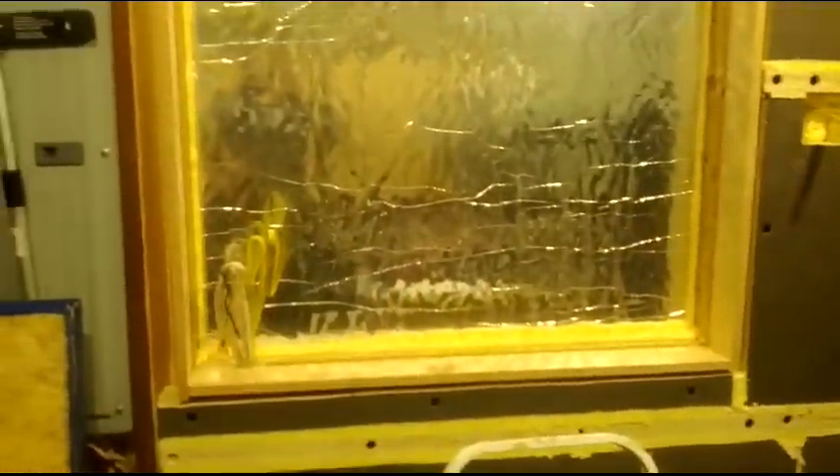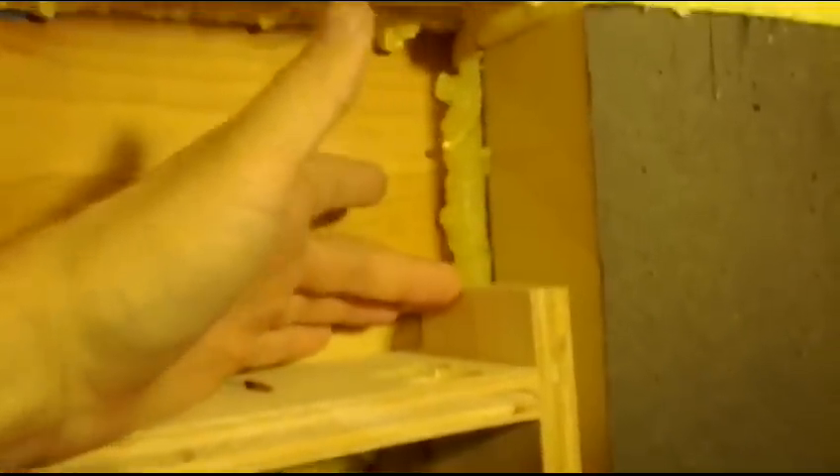So here we are. I have finished the extension jambs for this center section, which is where this beautiful saw is going to sit tucked into that space. Everything is pocket screwed. Used relative dimensioning to figure out all the measurements. The sides are left long — no reason to cut them down. A little gap here will get filled with insulation. Down at the bottom where I don't have room for pocket screws, I just put a screw in the end. That's tonight's progress on the shop — we'll keep moving along.